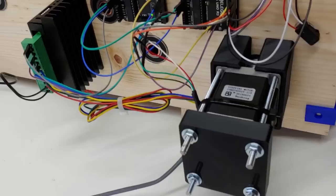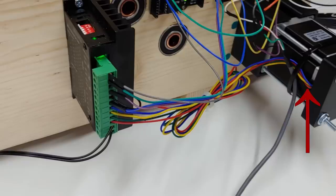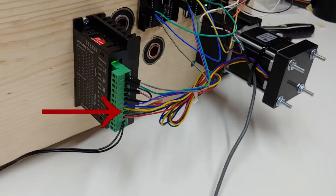To appreciate the value of the stepper driver, we must know the basics of how the stepper motor works. In simple terms, there are four wires that come out of a stepper motor, which power is applied to in different sequences to rotate the motor shaft. The stepper driver simplifies that sequence for us. For example, we can tell the stepper driver to turn on, move a specific direction, and the speed it should move. The stepper driver then translates those instructions and turns on the four wires in the correct sequence to move the shaft of the motor.